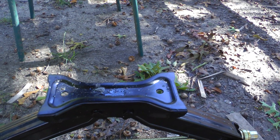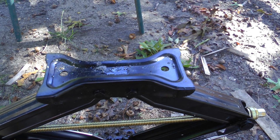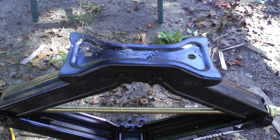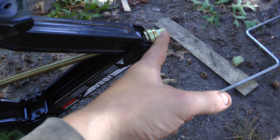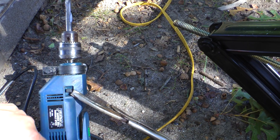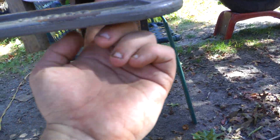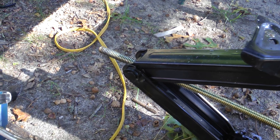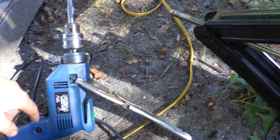I'm trying to do this as inexpensively as possible, as you might have surmised. This is how you can make yourself a little redneck drill press. Use a little crank handle — you could also use a socket and a wrench — and slowly push the jack as you need it. Go a lot slower, keep your RPM around 300 to 400 for drilling holes like this. Anyway, that's just a little tip for a redneck drill press. Like the video, subscribe. Cheers!